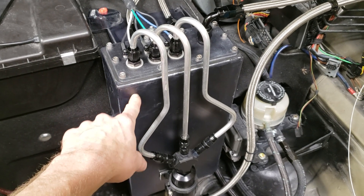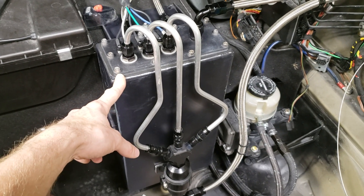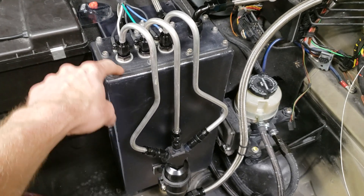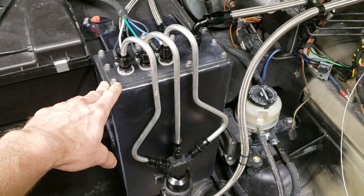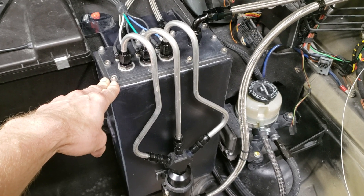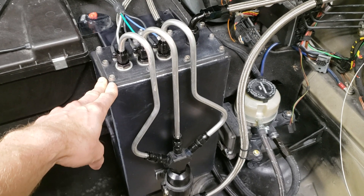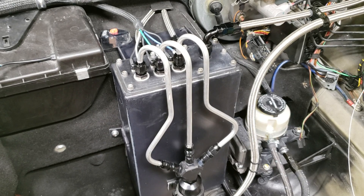These threaded fasteners are blind-holed into the tank, so clearly they're going to leak through the threads. First I thought it was going to be fancy, and I machined an O-ring groove around the whole cover, which I had planned to do anyway. Then I attempted to seal the threads with an E85 specialized sealer — didn't work, because obviously it's not a pipe thread, it's just a straight thread. And I tried O-ring bolts. That didn't do it either.